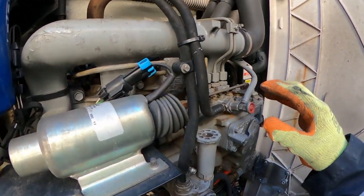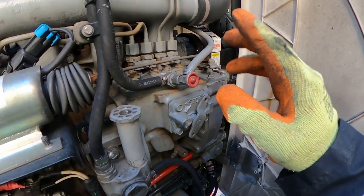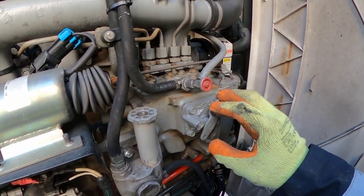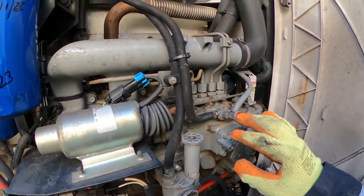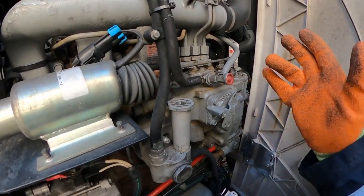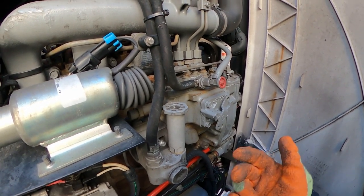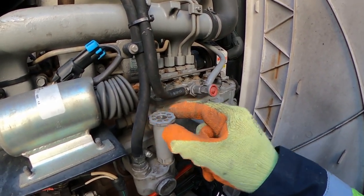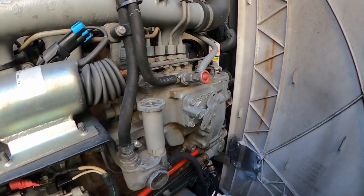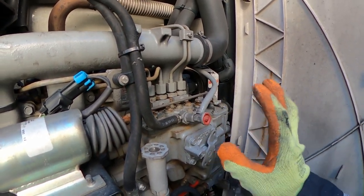And do not forget this thing — that's it, you're good to go. Some trailers don't have this exact setup, but about 90% of trailers have this same system. This is a Carrier unit, by the way. Basically what you have to do is prime the fuel pump — twist it off, it will pop out, and that's your actual pump for repriming. This other part is some kind of vent.